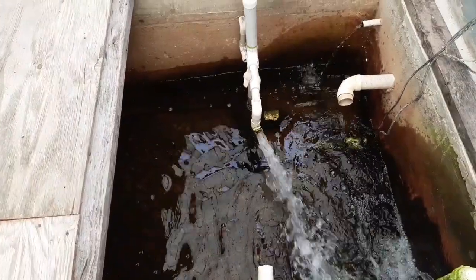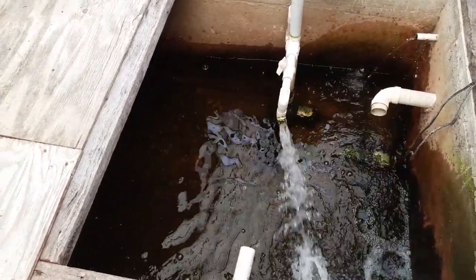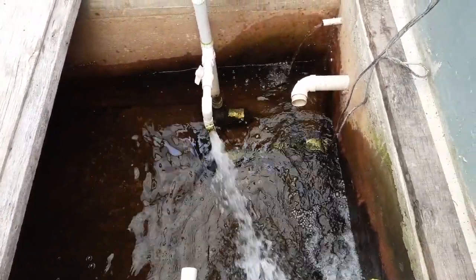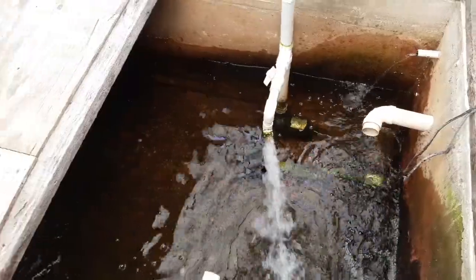Okay, so basically every aquaponic system is going to have a fish tank of some sort, because the fish are the engine really for your aquaponic system, right? If it's a fairly big system, you're going to have a sump tank of some sort. So this is our sump tank, right? I've uncovered it so you can see. We have one pump basically that moves the water throughout the entire system, and we have a feedback line there to take some of the pressure off the pump. So we're talking about media beds.